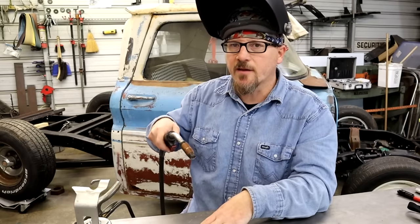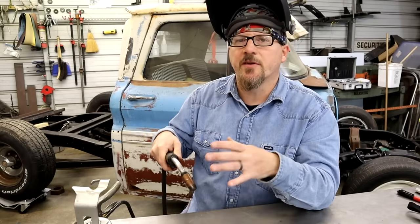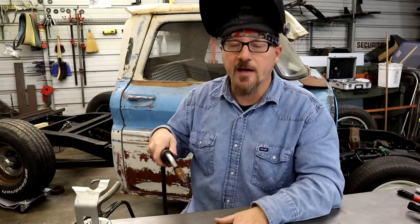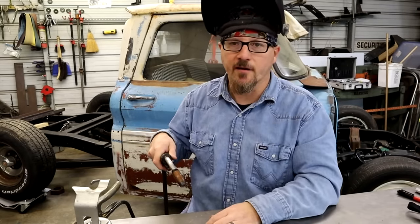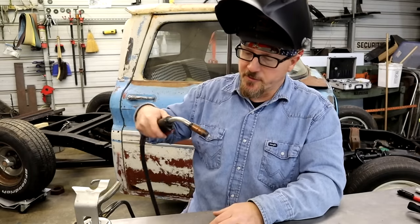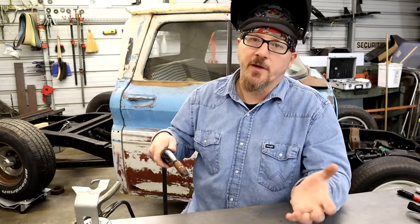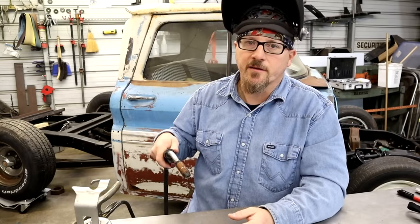But I say practice a lot before you get on your stuff and put yourself into some awkward positions, because you're not always gonna be welding on a nice flat table with good lighting coming down on it. So get you a bunch of scrap and just put yourself in out of the way positions, like you would be in realistically on a car, because that's what I usually work on, welding exhaust, welding in patch panels, whatever.